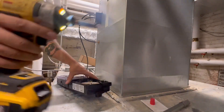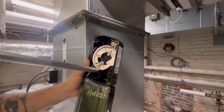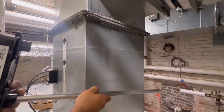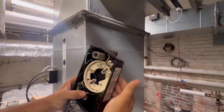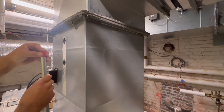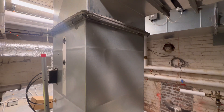After that I put the test tube in. This is on a supply duct, so I make sure the holes on the tube are facing down, so that if there's smoke going through the duct it's going to go up into the test tube.